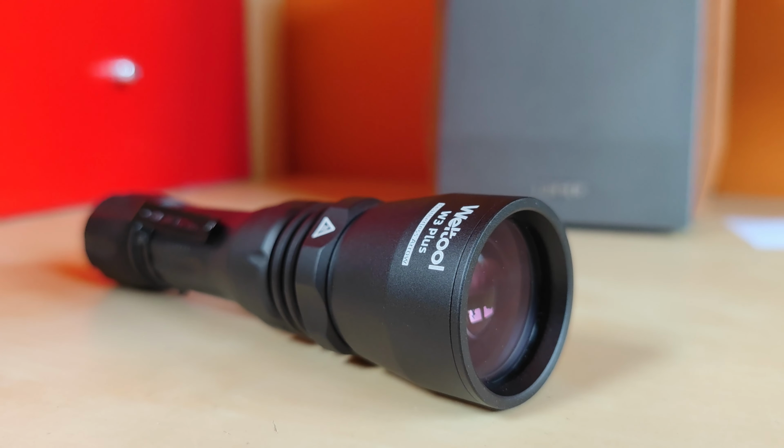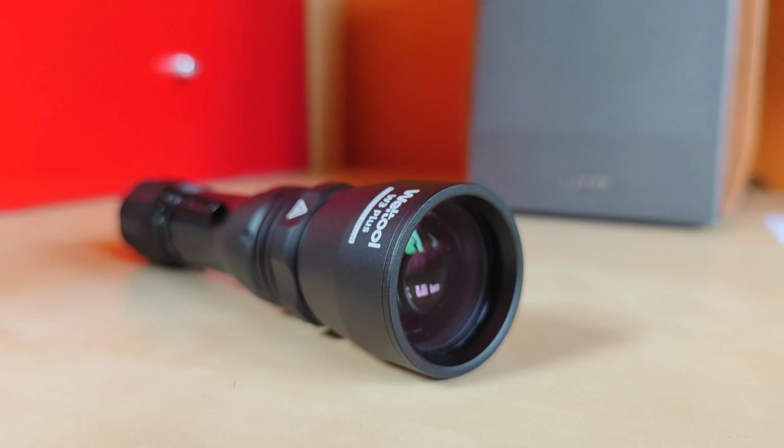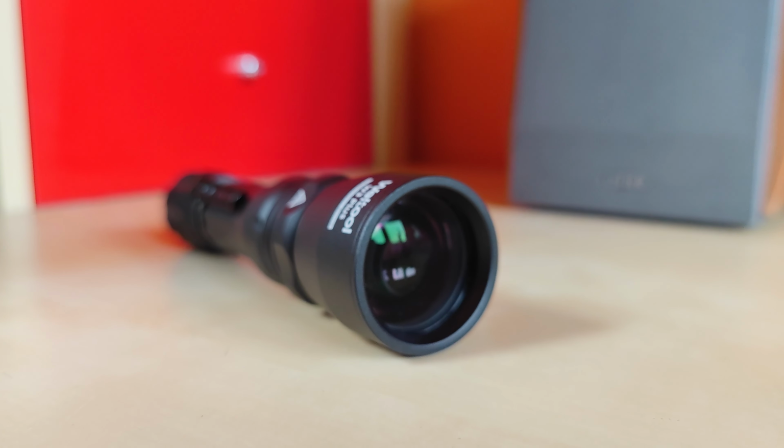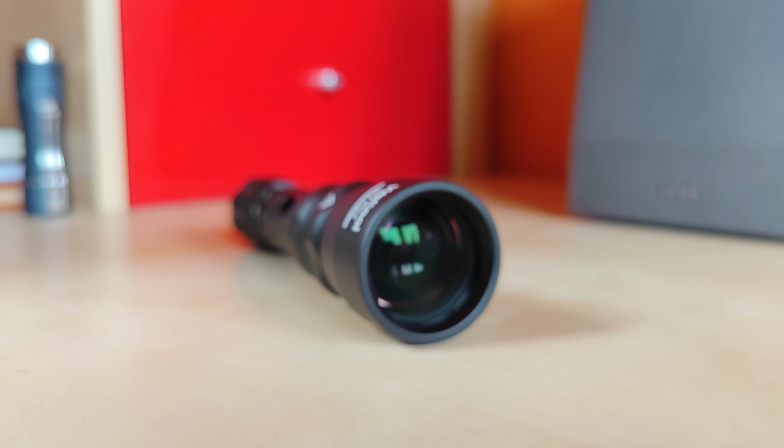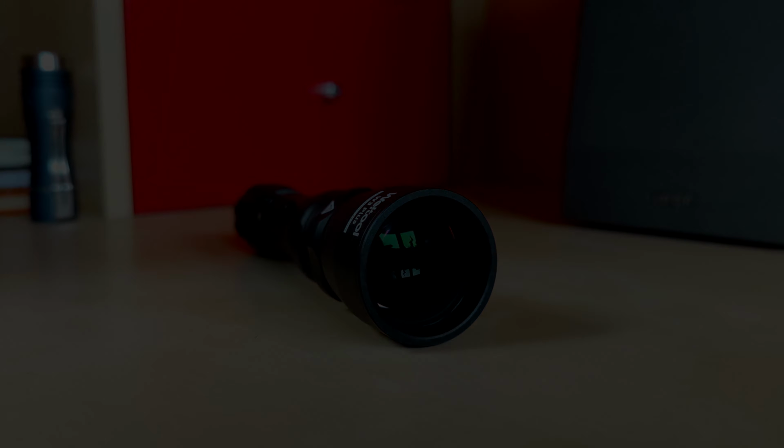The performance is definitely solid, and you've got a good regulated driver and high capacity battery that will support your needs of long runtime. However, bear in mind that 2 hours on a 5000 mAh battery is still a great result for LEP, however not for a flashlight itself. LEDs basically are more efficient than LEP, so we have to expect slightly shorter runtimes with such type of flashlights.